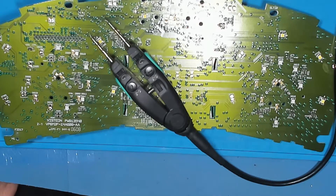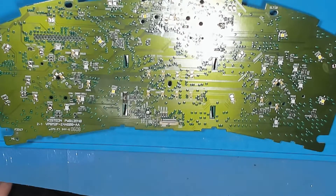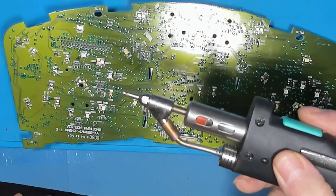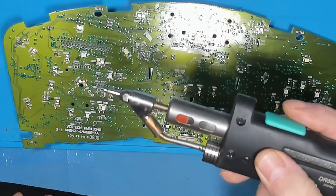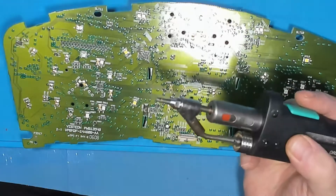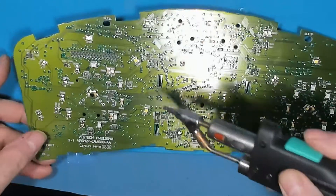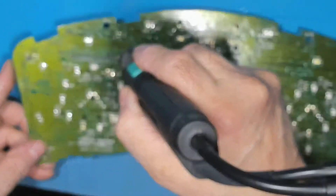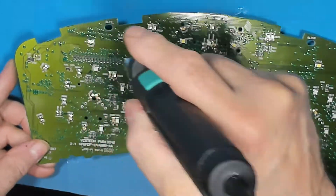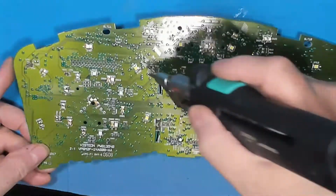The other one I was going to show you is the solder extractor they use, or what JBC do. Unfortunately I've removed all the parts, but I can show you on here though. This is the device — the air pump is separate, it's a vacuum pump. You have different size nozzles with different size apertures, which is pretty good. So it's literally the case of sitting on — pump and the solder's gone.